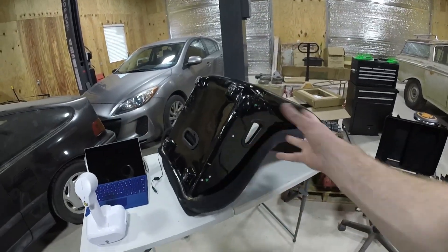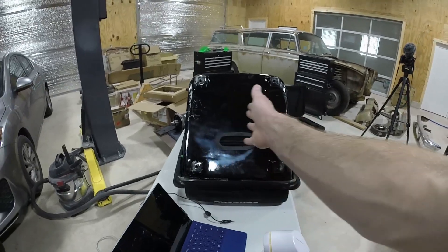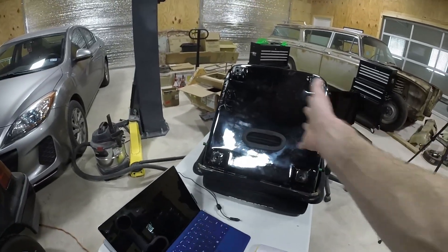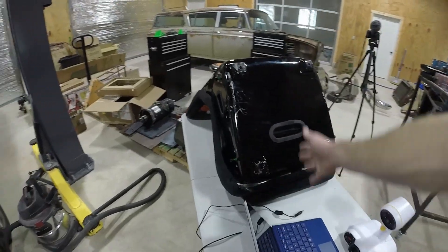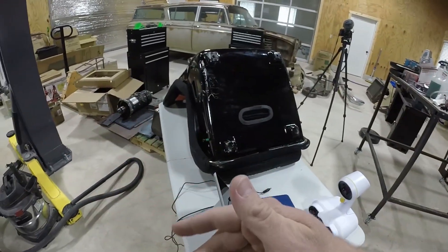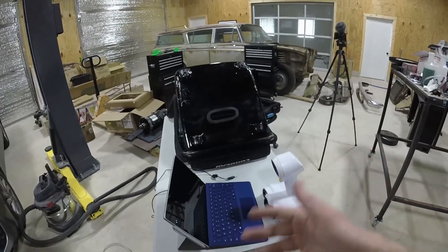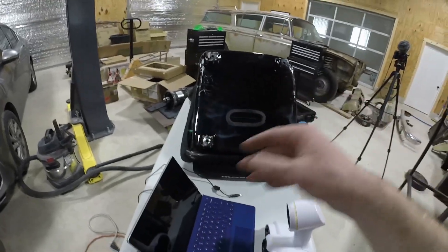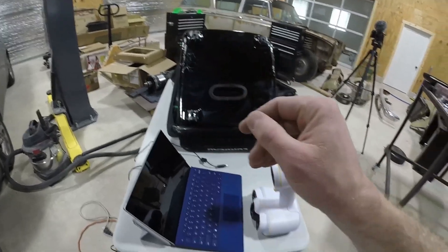I won't need to catch the top side of the seat at all. This seat's symmetric — this side and this side split the width of the seat. I wanted to center the seat in position with the steering wheel. I'm going to do that by finding this plane and splitting the difference down the middle. That's going to become my midpoint. Forward to aft, I've got that figured out as far as where my leg positioning goes. From there I'm connecting these bolt holes and these planes to the ones on the floor that I've already picked up. As long as I make that centerline geometry happy, everything else should work out.